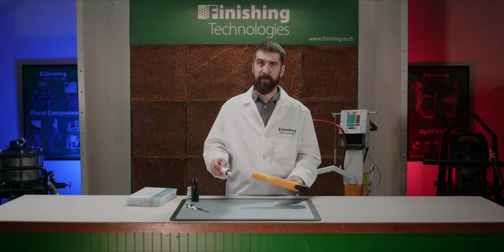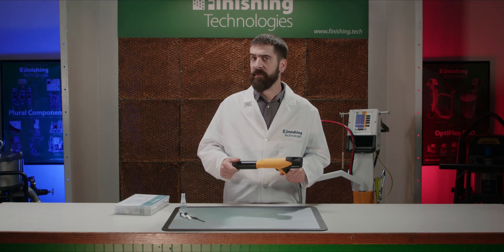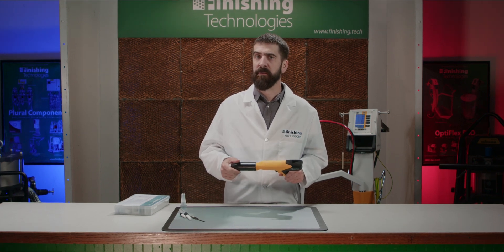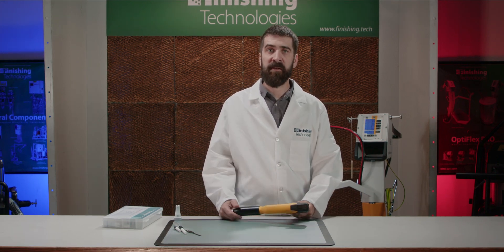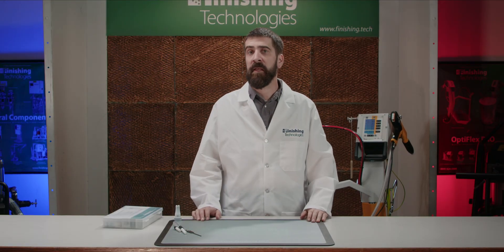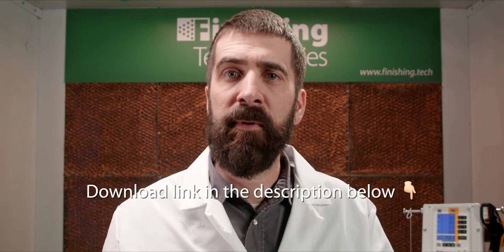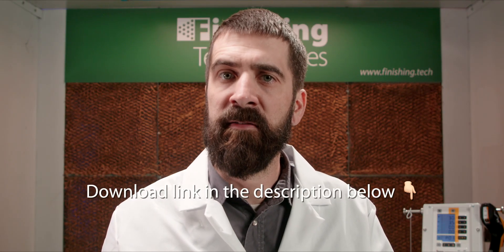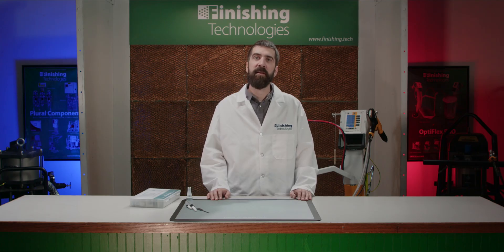So there you have the bigger areas requiring regular maintenance for your GEMA Optiflex units. Other models, such as the fluidizing or hopper unit, or various lab models, may have additional needs, so let us know if you need help with those. A lot of our customers choose preventative maintenance and have schedules for replacing parts regularly. The GEMA E-App, which you can download and use with your Optiflex Pro units, can help you track what needs to be maintained as you go, offering reminders on some of these key areas. This, plus our maintenance kits, can help you be sure your equipment is efficient and reliable.